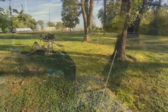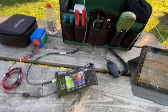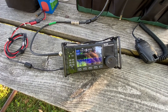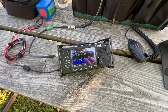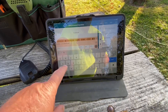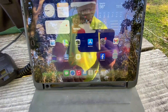Here's the setup — we're all ready to roll. Got the radio set out, got the hamstick on the field box mounted, and we've got the Xiegu X6100. We're going to use an external battery so that when someone tries to steal my frequency I can bump up to 10 watts so they can hear me. Otherwise I'll be operating 5 watts QRP. I've got the iPad here with — getting old is terrible — Ham2K, that's what it is.